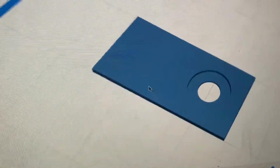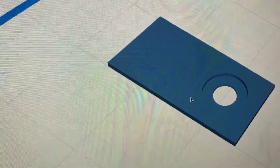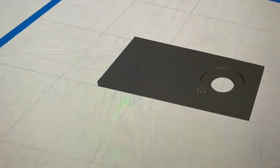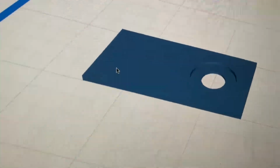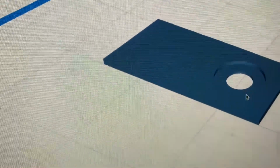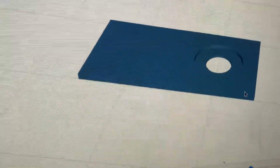So let's get back to our file here. We've got a hole where the punch is going to come through and a hole where our quarter is going to be placed, and the hole for the punch is perfectly in the center, and we've got a little bit of extra here to kind of position it in the punch and die. And I might modify this later so that there's a little lip so I can actually flip the quarter out of this once I'm done punching a hole in it, but that's for another day.